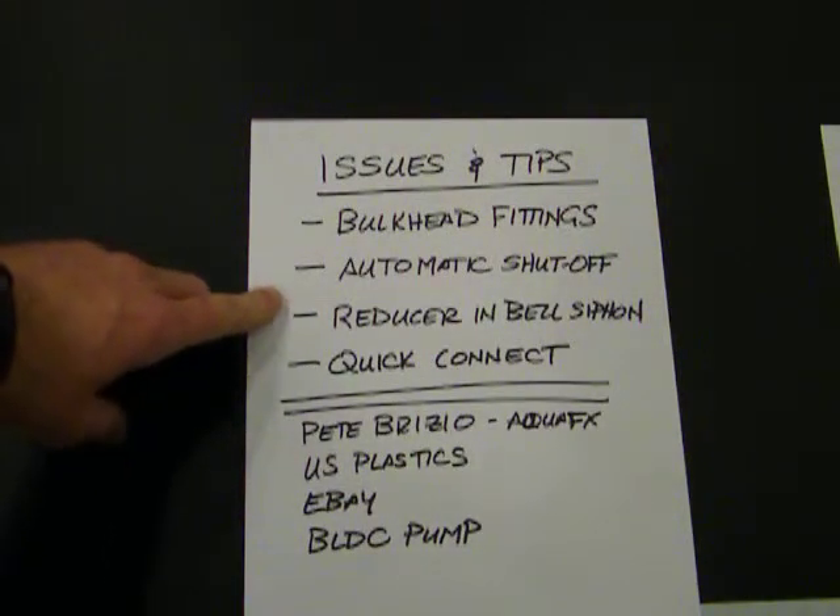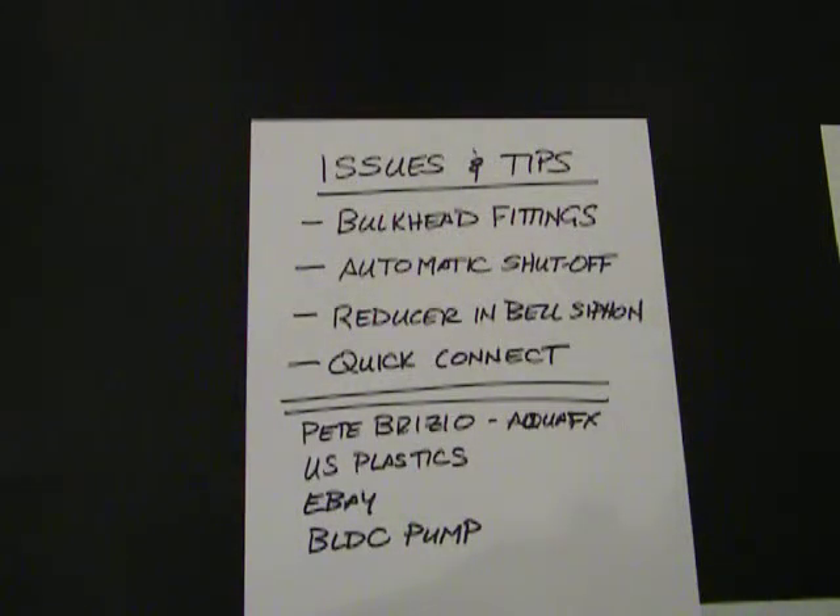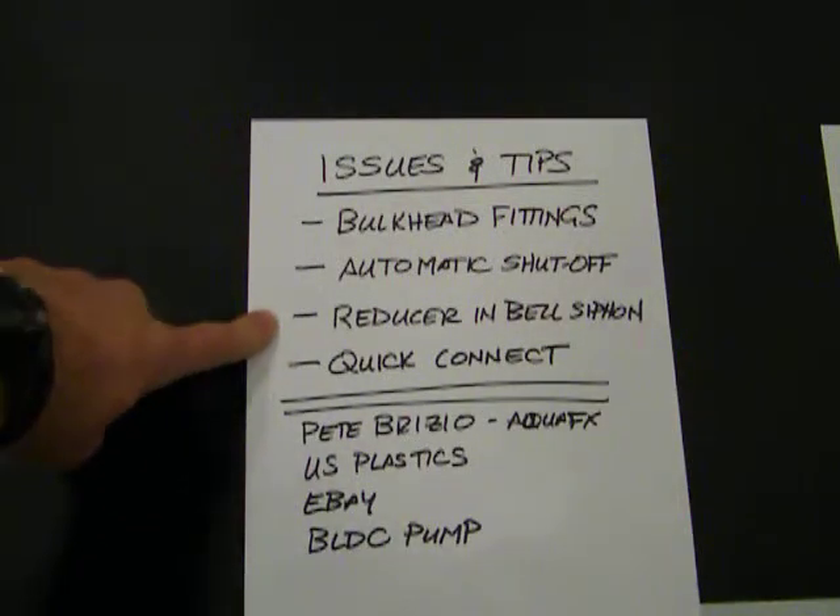Also, regarding the reducer and the bell siphon — I do engineering, ironically water distribution engineering. When you have a device working off of system pressure with no external power source, you have limited rangeability. If you want a bell siphon to start very easily, you can use a reducing fitting inside to force the air lock. What that'll do, though, is reduce your overall capacity — robbing Peter to pay Paul. But I would definitely recommend putting a reducer in a bell siphon. I used a threaded fitting down to half-inch, and when that water lands on that shoulder it splashes and forms an air lock very quickly.